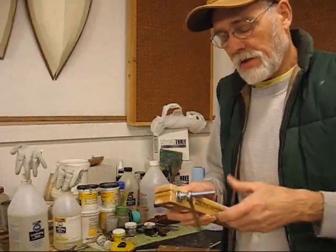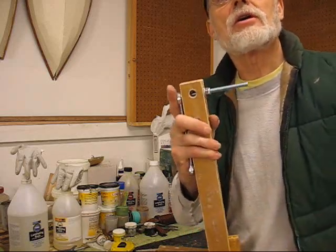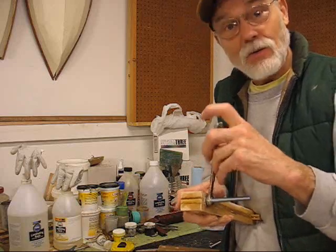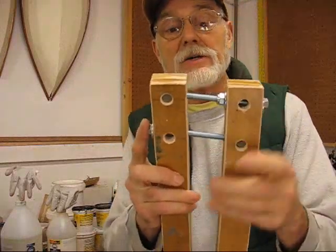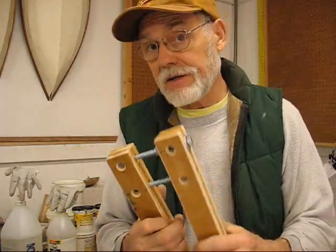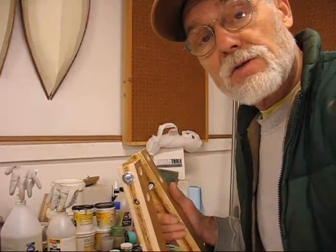With the top bolt, it has a nylock nut and washer on both sides, and a nut coming down. For those who are sharp, you'll ask why I drilled that extra hole — every time I make clamps, the first one always gets that extra hole. You only need one hole per side but they're staggered from side to side. I've got them with the head of the bolt on either side, so some holes didn't need to be drilled. I do this pretty much every time — I forget I only need one on each side. On the flat face, these always need two.